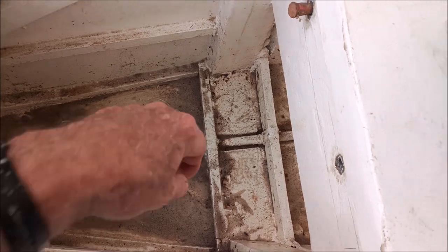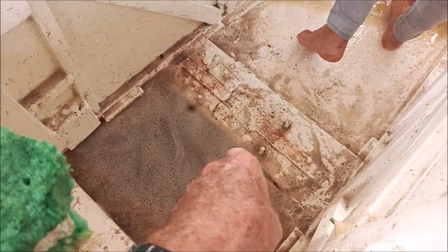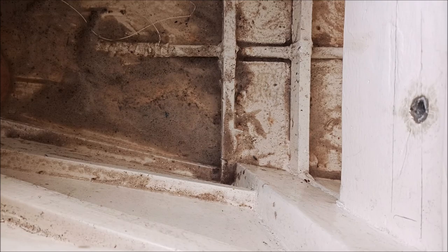That's the propeller shaft, by the way. This is where the engine mounts, right? I don't know if you see those 4 bolts. There's one. Mounts there. And the propeller goes through this shaft here. I made drain holes through here, there, and there. So this water should drain back into here and out that drain hole.